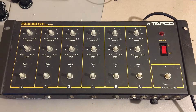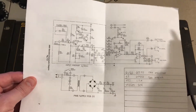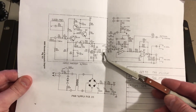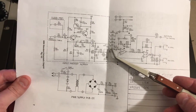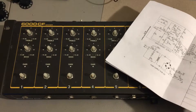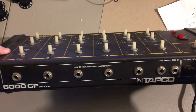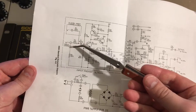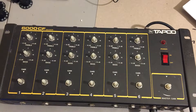The way we're going to do that: each channel strip feeds from the treble control into a resistor. We're going to disconnect from there and wire it so it goes to the jacks in the front. The XLR jack and the quarter-inch jack both currently go to the input — we're changing that so the XLR becomes the input and the quarter-inch jack becomes the output.